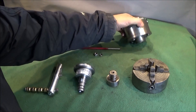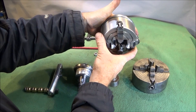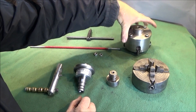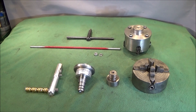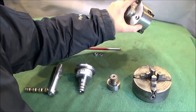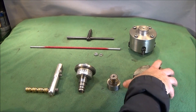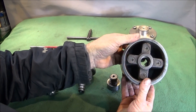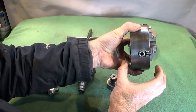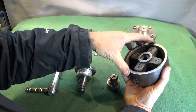In that video I showed how I made this back plate here and actually held this chuck in the mini lathe three-jaw. I've always used this one for one-off components just where I need a quick four-jaw setup — this is the actual four-inch four-jaw chuck that came with the mini lathe. I've also got this five-inch chuck which is quite hollow at the back, very lightweight and narrow, giving you plenty of room on the lathe bed.